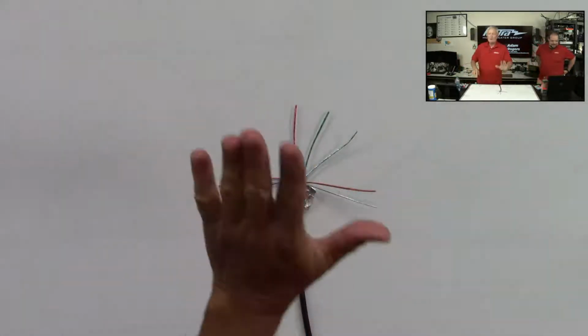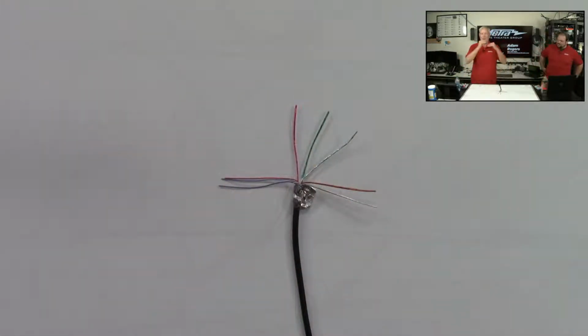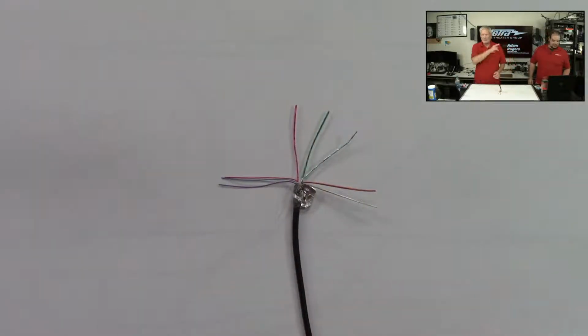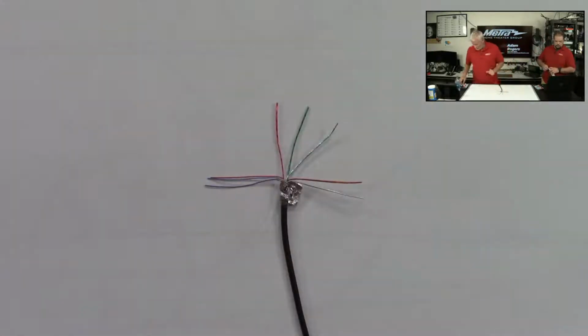Of course. So, we've got the 3 primary colors, and we're looking at the headroom, and by now everybody should know what headroom is. You want to have lots of space around that eye mask, but you also have to look at timing, meaning that transition is the same red, green, blue. Because if it's not, you're going to wind up with sparkles. Or worse, no signal at all if it gets really bad. So, when we're looking at this, we were talking about inter-pair and intra-pair skew.